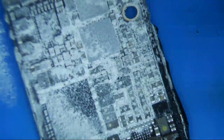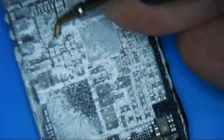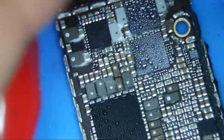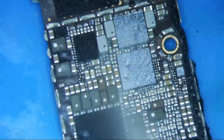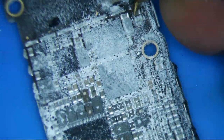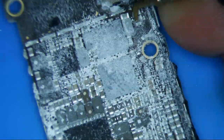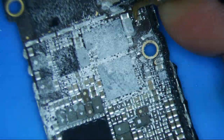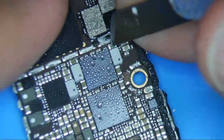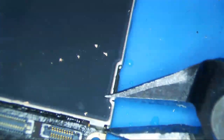Let's just go up to the top here and try that. I still don't really see anything. Sometimes it's the cap that you're using that is shorted. Still don't really see anything that's melting faster than others. So it's probably going to be the front side. Good chance that it's this one — it's always this one, right? It's probably one of these caps on this corner right here.